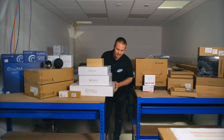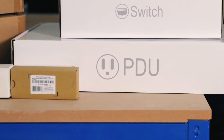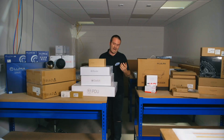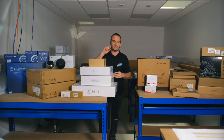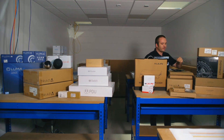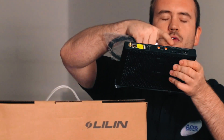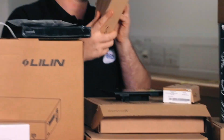One extra box you might notice is a Pakedge PDU — the device we use to do resets on the service page on an AOS job. You're going to reset devices and bring all that through. If you've connected the rack up properly using the IEC connectors and flex leads, devices should turn off when we use the wheel on the front. We're also going to use the temperature sensor and configure alerts, so when the rack reaches above a certain temperature, it will email you. We've also got a serial connector for the Control 4 controller using one of the serial ports on the back.